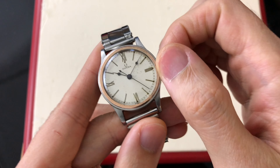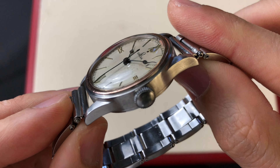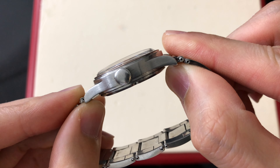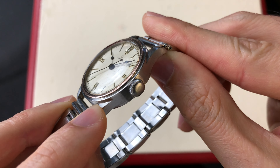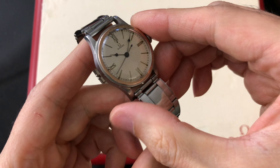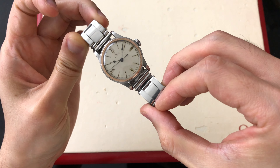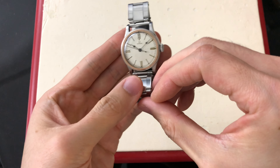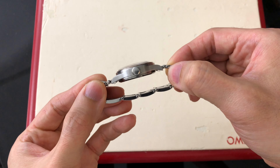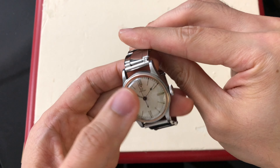The original solid stainless steel case has a unique rose gold cap bezel — an actual layer of solid gold over the steel. The majority of 1930s vintage wristwatches are made very small. This case measures 30.6 mm in diameter excluding the crown, by 38 mm from lug tip to lug tip. The case thickness is 8.8 mm without the crystal and 10.9 mm including the current crystal. The crown is 6 mm wide and 2.6 mm thick. Case lug width is 16 mm.